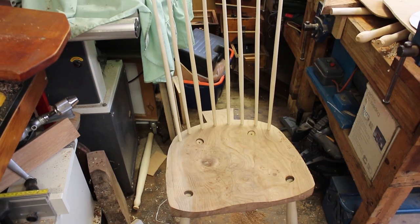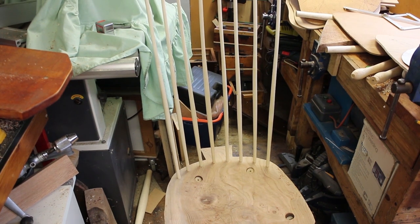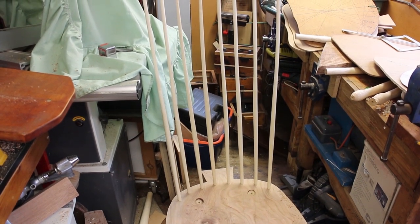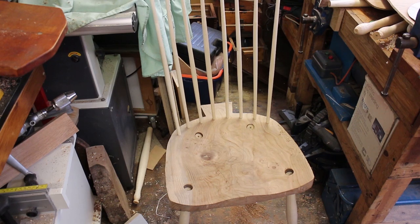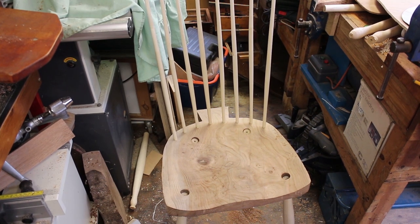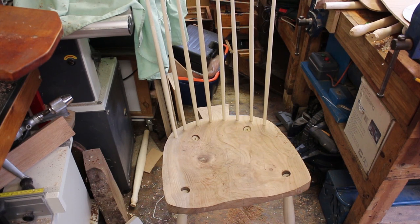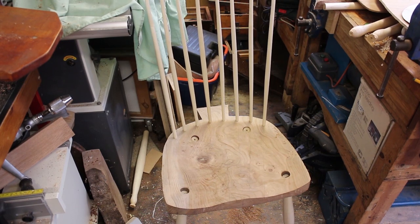That drilling seems to have gone okay. I'm actually looking at this and slightly wondering if I want a sort of central splat rather than those two spindles in the center. For strength I may need a central splat because these spindles are quite long — I'll have a little think on that one. Seat making is always a bit nerve-wracking so to get that broadly right is great; I didn't want to ruin that nice bit of elm. I know I need to do more work on the seat but that's easily done. Hope you've enjoyed watching that part of the seat making — there'll be a bit of assembly coming up next. Thanks for watching.